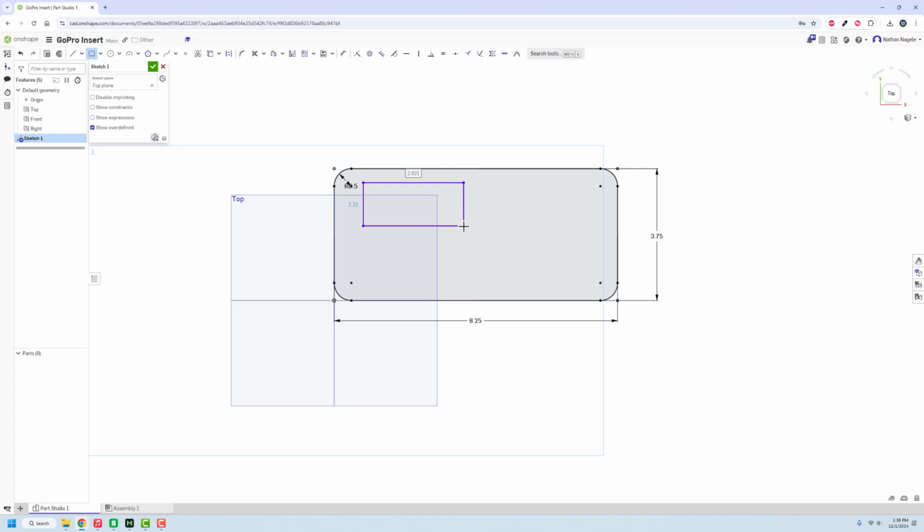And with the media mod, it's telling me as far as its thickness, it's 1.16, and its width, if we go all the way to the outsides here, and I'm going to try to include the little cold shoe too, is 3.55. So I'm going to make that 3.6. And then the depth there, again, was 1.16. So I'll make that 1.2. Again, that's just accounting for some of the size variation that we want to have and some distance things. And then we're going to put this in there. Let's say we want that to be 1/8 of an inch away from there. Actually, we're going to have to do that larger because of the fillet.